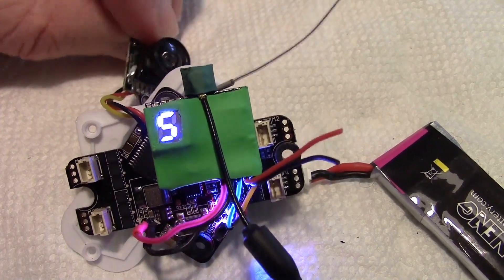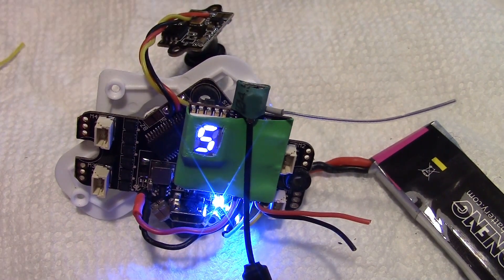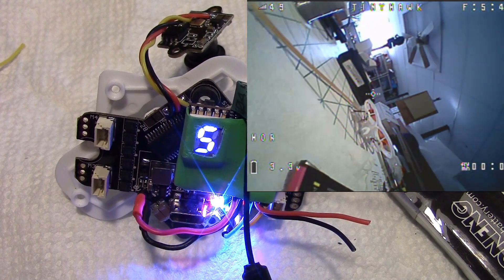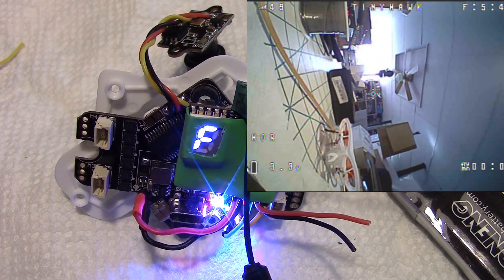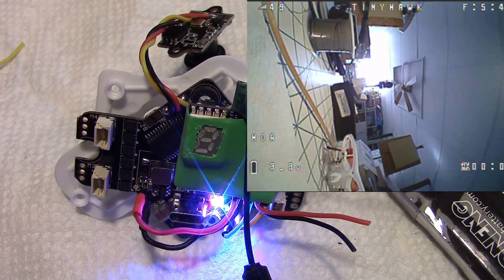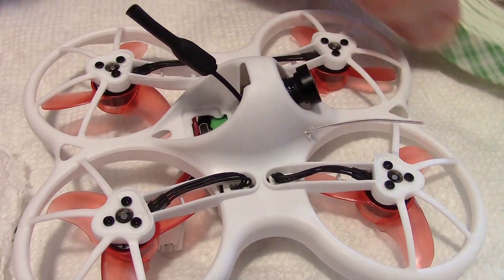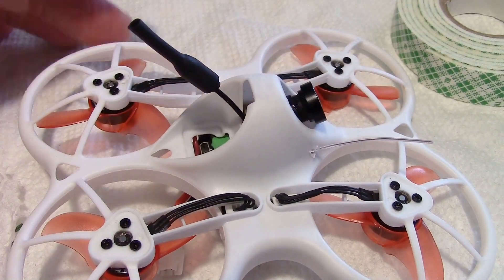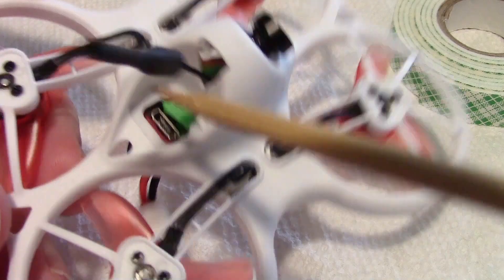Now I've got a battery plugged in and I'm going to give it a little test. You can see on the display that I have the Fatshark band set to F, a frequency of 5, and the power level is 4. I'm going to test it with the goggles and see how it looks. The picture looks clean and I don't see any problems, although the goggles are very close to the transmitter. The Tiny Hawk is all back together now and I used some 3M double-sided tape to hold the board down to the main board. Surprisingly I didn't have to cut out any of the case to fit the new transmitter into the Tiny Hawk.